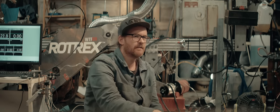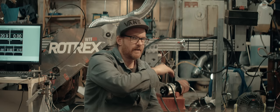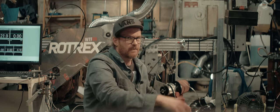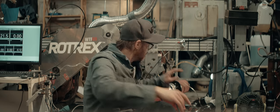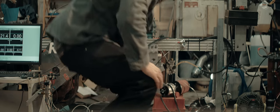So airflow is not higher. I haven't underestimated airflow. I've overestimated airflow through the engine. I think that's what's been going on. Definitely got worse with a different ratio, more air. For now, no blower, completely normal two-stroke engine. Let's see how it behaves. First under no load.